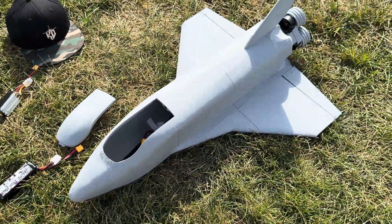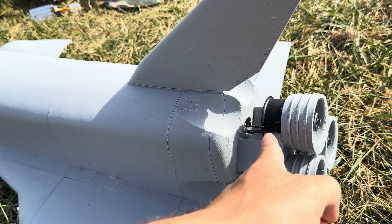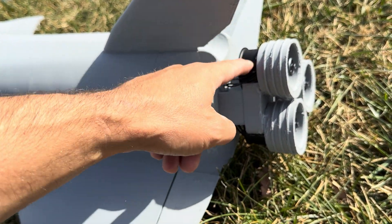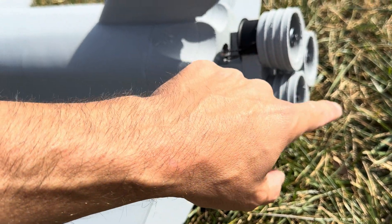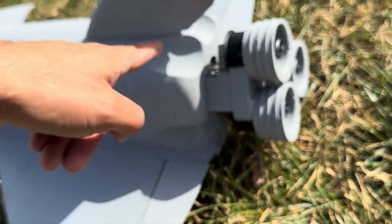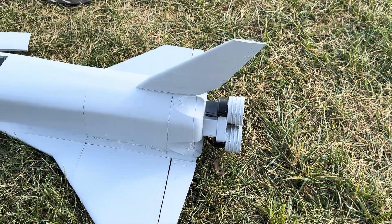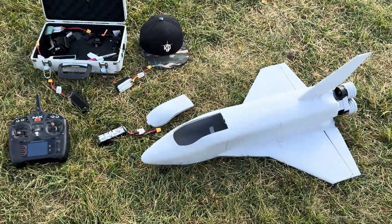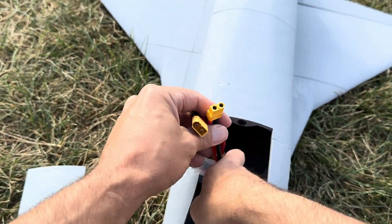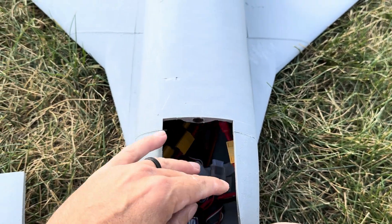We're back for battery number three. I wanted to show you how easy this thing is to build. This piece inserts into a negative space - the whole motor mount prints flat. You glue the motors on with hot glue, and these little covers just glue on with hot glue too. There are three holes in front of each motor - you put the ESC and wires straight through. All motors connect and everything just plugs right in. You can build the whole plane and assemble the electronics afterwards.